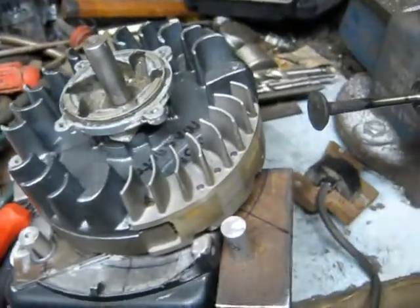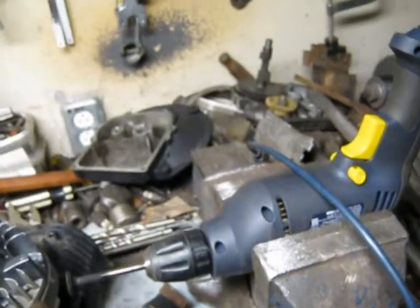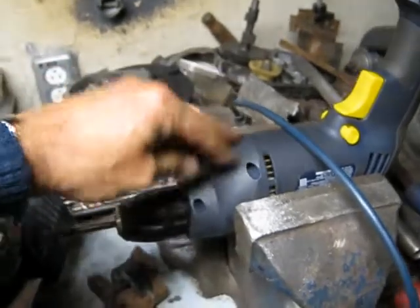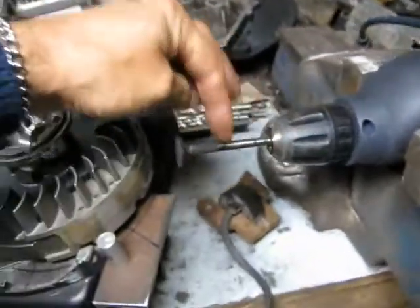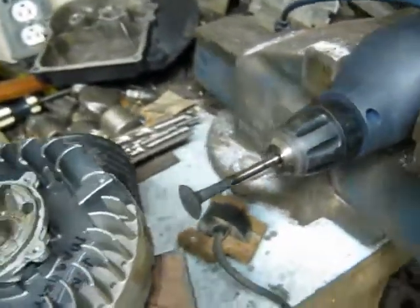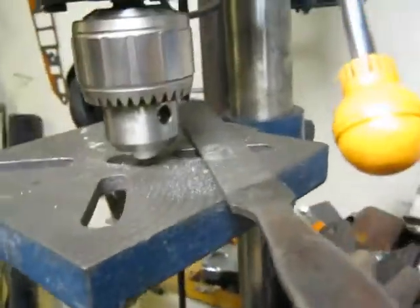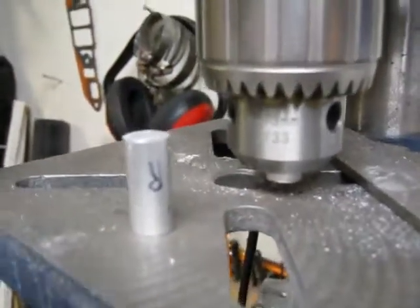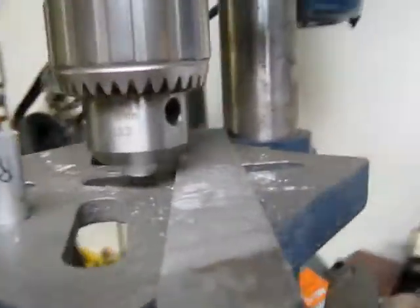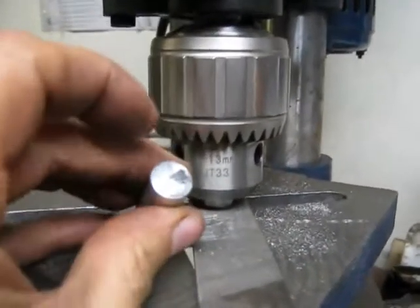I remembered the idea of using Lee's lathe — a friend and mentor of mine named Lee. Back years ago he used to chuck up a three-eighths or half-inch drill in the vice like this, chuck up what he needed turned down, and he'd file it — he'd make all kinds of fancy bolts and different things that way. So I've reinvented it here on my drill press. I chucked up the aluminum stub in there, turn it on, and it's fairly close — you don't want to jam your file.